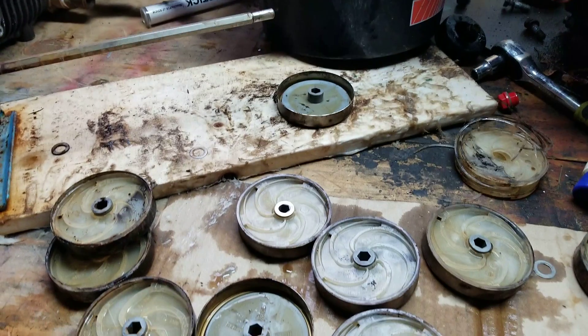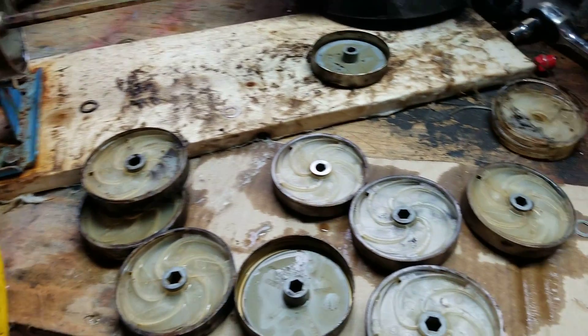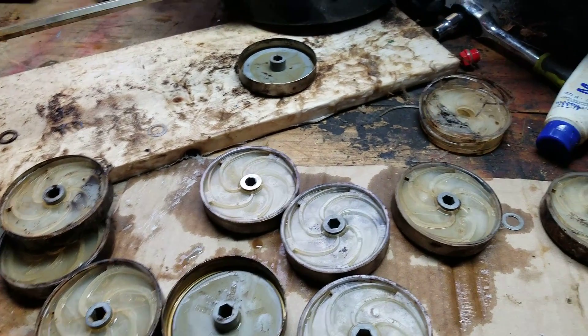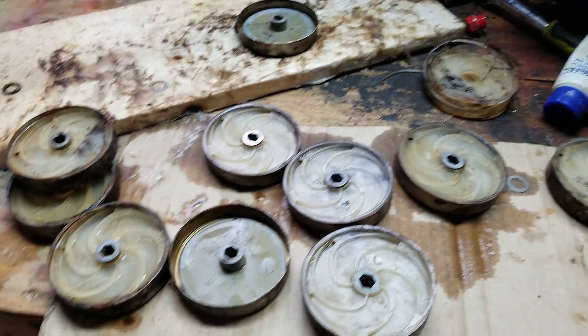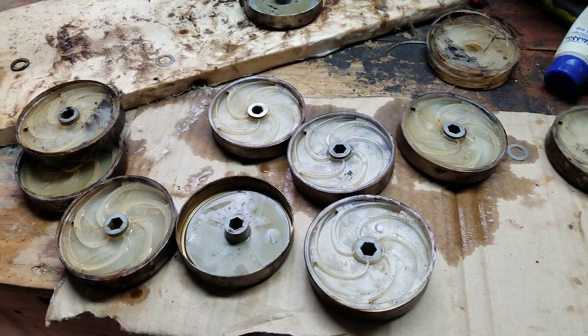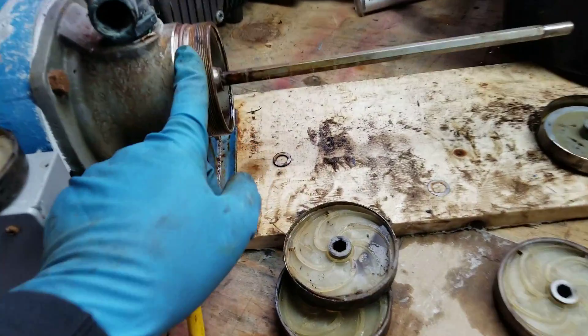Fortunately with a booster pump it is not an expensive repair to replace all these things — they're like three bucks a piece, compared to other pumps where the check valves could be $30 each and you've got three or six of them. I could literally replace the entire thing in here for about 90 bucks.